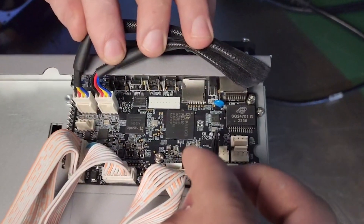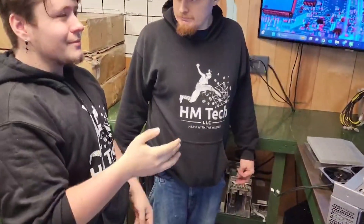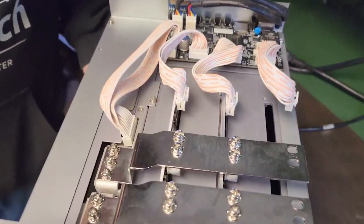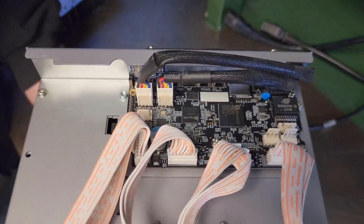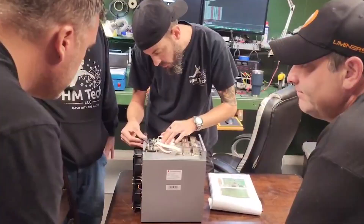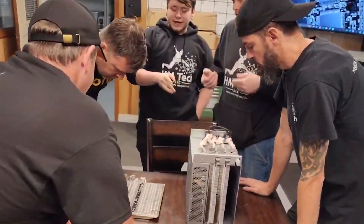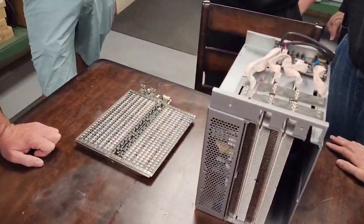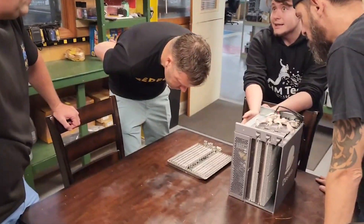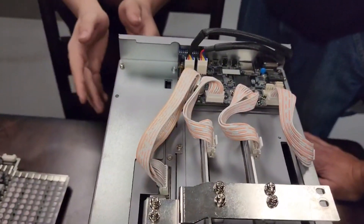So what's the benefit of having the oscillator on the controller rather than the hash board? Arguably there's something to be gained from having the locus of the clock — which sets the comms protocol frequency — on the controller rather than the hash board, which is a super temperature-contingent environment. The crystal here gives a base frequency for the controller to multiply off of, and each ASIC has an onboard PLL VCO divider. When you're talking about a UART or SPI signal bus — technically UART doesn't require a clock, but your transmit and receive need to be within 10% of each other.